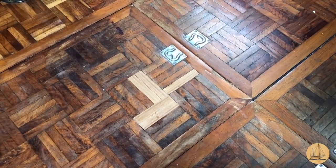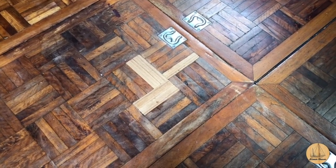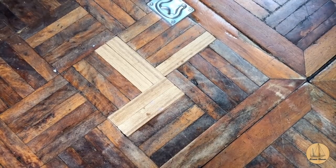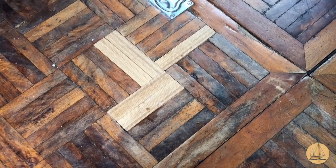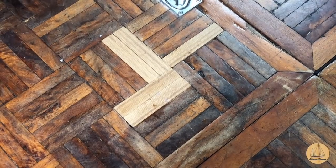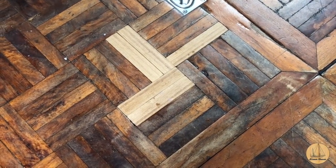Yeah. No. Okay. Well, here we have our floor repair. So slightly different color. We'll sand this all smooth and probably, actually, you know what we might do is put a little stain on it just to see if we can get a fairly close match and just blend it. So we'll sand those level and then just sort of fair out or blend out the color. Deb's really good at using stain and blending it with existing wood to kind of match the color. She does a real good job with that.